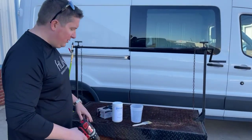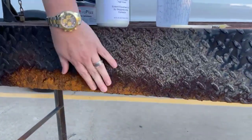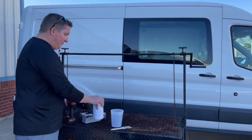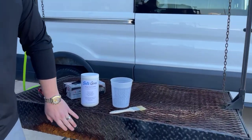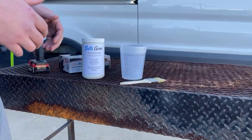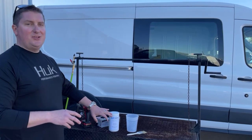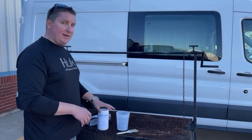We've got a wire wheel. You can see right here there's loose flaking rust — this is a barbecue pit. You also want to wear gloves, as this is a strong acid. The way it's converting: this is ferrous oxide and we're going to convert it over to iron oxide, and that's going to be through using an acid. There's also a resin on top of it. This is the same resin used on the industrial side of things — it's a unique resin, the same stuff used on cannons that come out of the ocean.